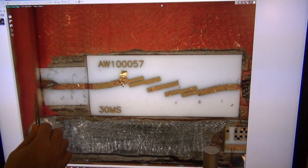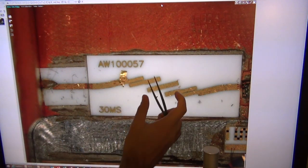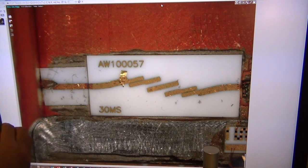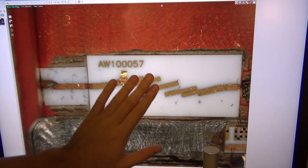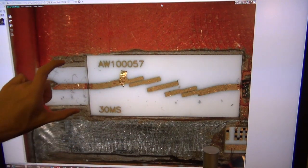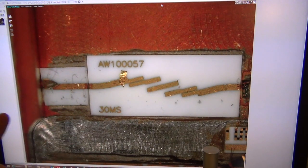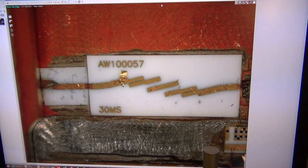And you can tell right away that this is a microwave filter, of course, and the distance between these lines and the shape of these lines will determine the frequency response of this filter. It looks really weird if you haven't done microwave engineering, but this is a fairly typical type of filter. Underneath this is the ground plane. So these are all combinations of microstrip and transmission lines and so on that make up the filter characteristic. This material looks to be ceramic, so it's a very high quality, low loss dielectric material that you can make a nice filter out of.